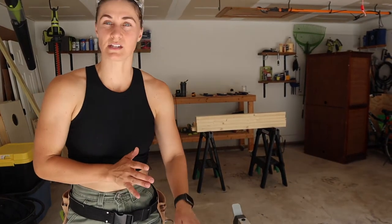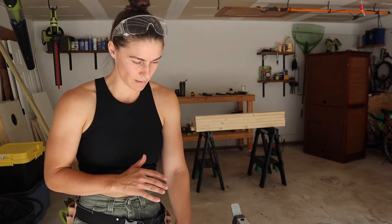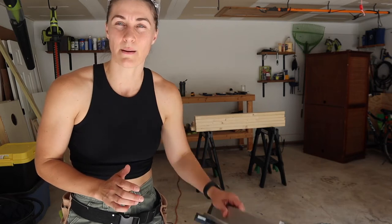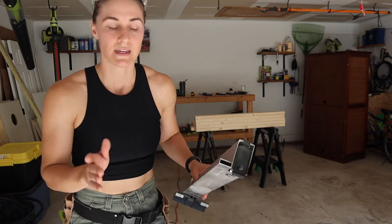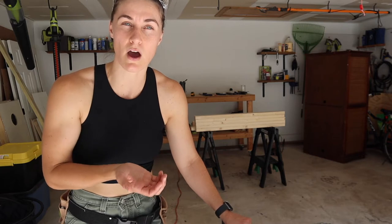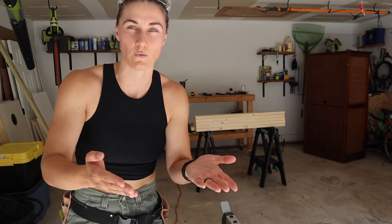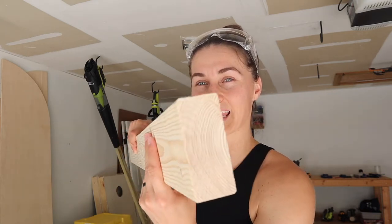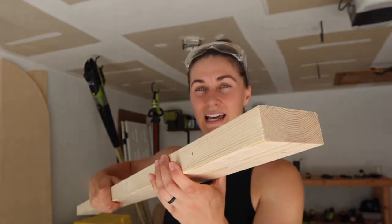I am now on the step of using the table saw. I have my table saw out right in front of me. I am going to grab each piece and set it on the fence, just enough to take that rounded curved detail off so I will have more of a very squared brick look, versus that typical 2x4 look with the rounded-over edge. You can see it has rounded edges — I want them to look like this, not like this.